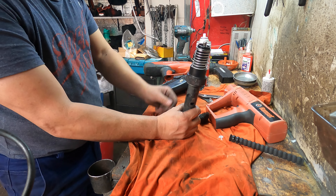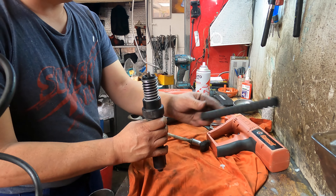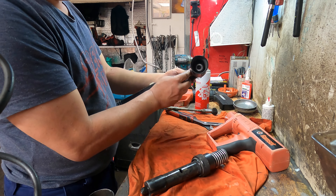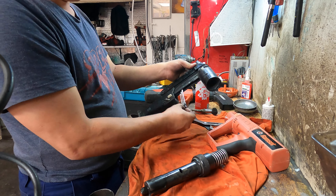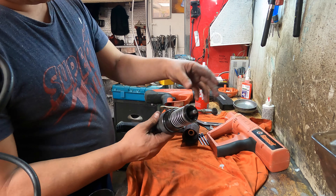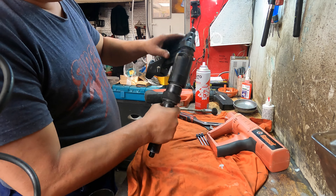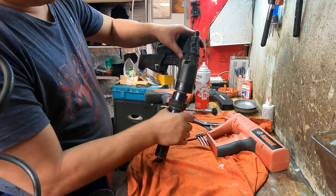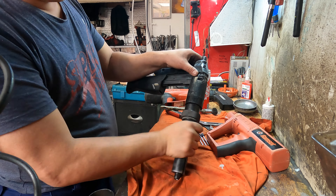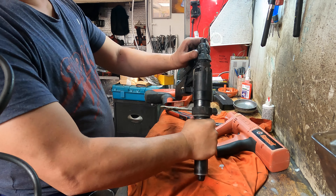You may need a new buffer - that's all you need. For the Ramset, the important thing is the safety engagement mechanism. When you're shooting, there's a little bolt here - go in and turn it until you hear the click and it should be right. Turn until you hear click click click and you'll be right.